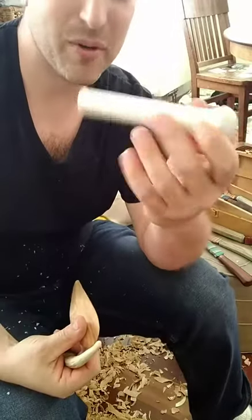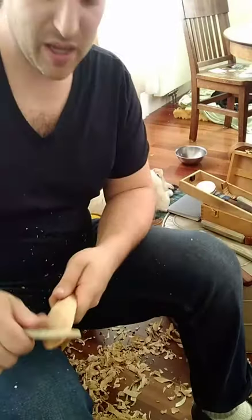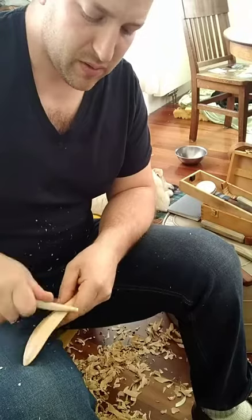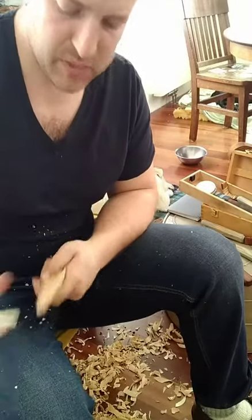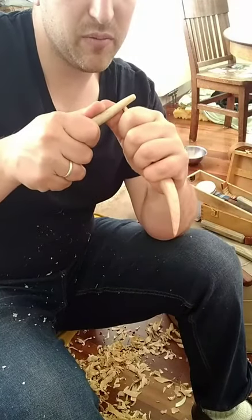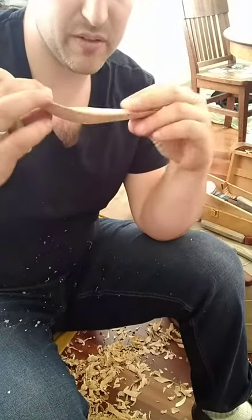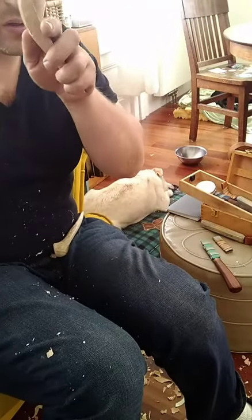But the glazed portion on the side, for whatever reason, doesn't burnish quite as well. Like I could use it to do this, but it just doesn't have quite the same effect. So I'm using a bit of antler that's been sanded down to 3,000 grit to burnish all of the non-bowl surfaces, particularly these ends here, you'll really feel, because a lot of times we hold the spoon right at the end, and if you don't burnish these little bits, it'll just feel sharp on your hand. And I'm really pressing quite hard, particularly on the end here. Like you want it to look polished. And at the same time, burnishing gives you a sense of where imperfections are. So for instance, there's one little spot where there's one wood hair sticking up.